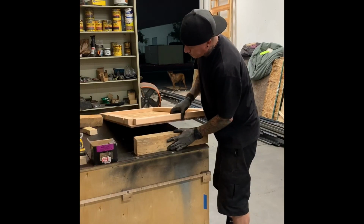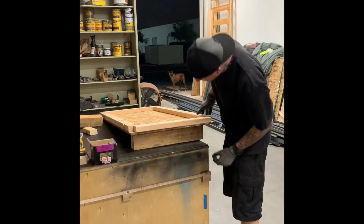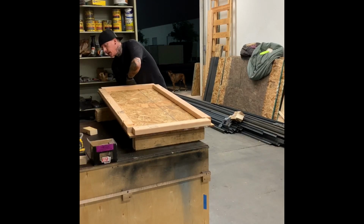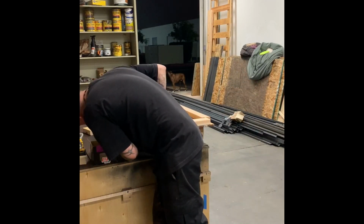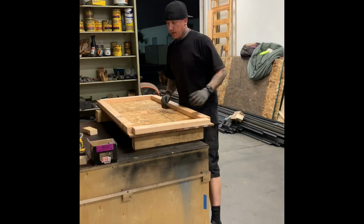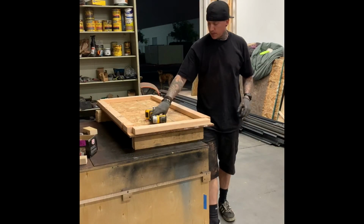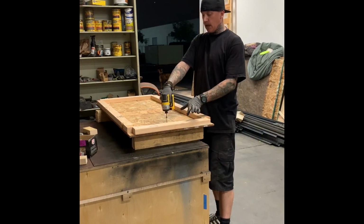I'm gonna put it right so it's lined up just inside of this so I can get to it. And I'll try to make it spaced right there. Just an eyeball thing. When you get smaller, you got to make sure you're wide enough for the prongs of the pallet jack. Anyways, like I said, 2.5-inch screws. So this is short enough, I'm just going to use 3. If it was any wider, I'd probably put 4. So I'll just make sure I'm just off the side of here.